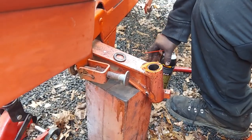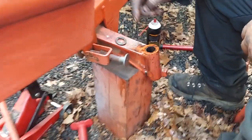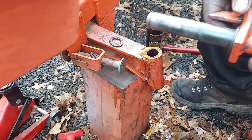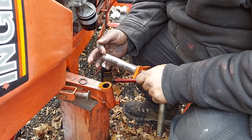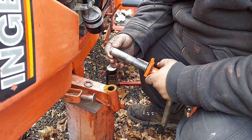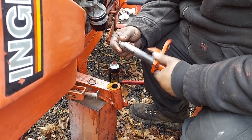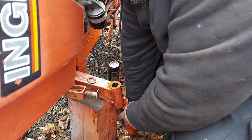You can go both directions if you're real dirty. The other thing at this stage you want to do is test your grease fitting and make sure you put some grease into it. You can see it coming out inside. That's real important. So we took this inside and just cleaned it up with some brake clean and just ground down the tip here where it got mushroomed over from hitting on it a little bit. Just keep this groove clean and undamaged for your snap ring. Sometimes all it takes is cleaning these up and you can get them in.